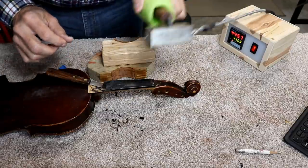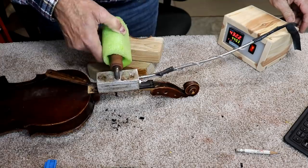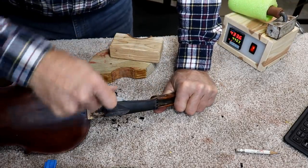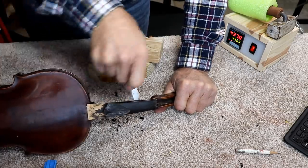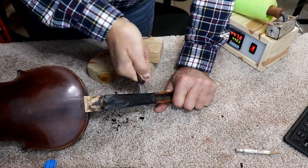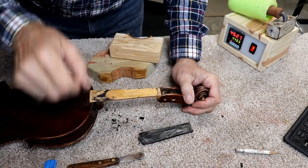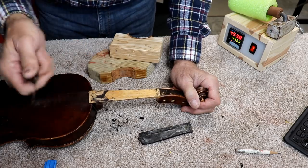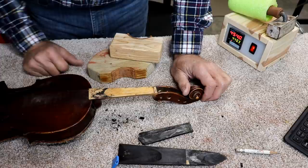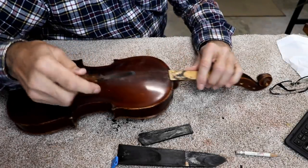All right, no point getting in a hurry — I'll put the heater back on there and give it another minute or two. It came off pretty clean, just that broken area there. I'm 99% sure that's hide glue, but I still don't see hide glue being any easier to take apart than Titebond. Titebond would have come off with no more resistance than that, and possibly less.